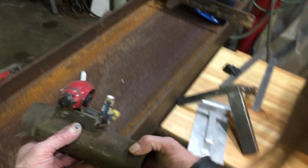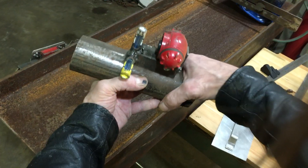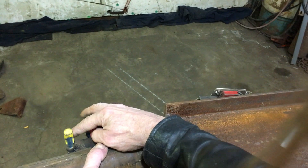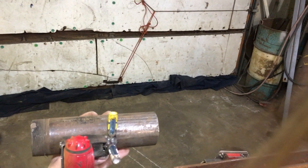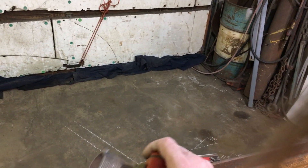My next tool I don't use very often. This is all just for a battery — I made it electric so we can see in the dark if I happen to be working in a dark place, but that was kind of an extra I didn't need. This tells me the angle of my pipe. When I've got to do a cope on one side and spin it around and do a cope on the other side, I can set it up so it's exactly lined up and do a quarter turn or half turn. You can also use this on larger pipe to find a location, then put it on the other side to find the same location and mark it to line things up. This works on anything from one inch to two feet in diameter pipe.